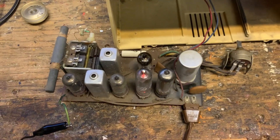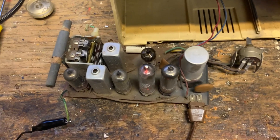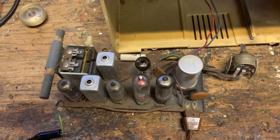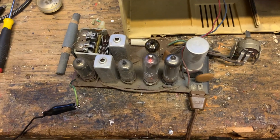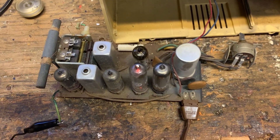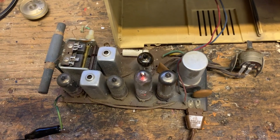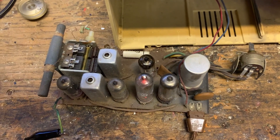It's very loud now — it's just the tube sockets, they're horrible. Super baked. I might need to try and tighten the pins or tighten the sockets — that might fix it. But it doesn't need any capacitors because it only has like three of them.